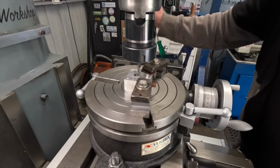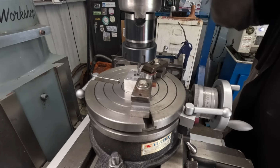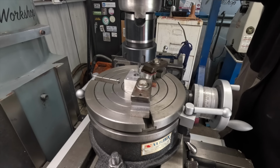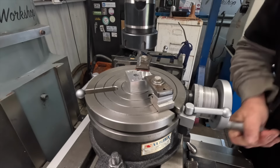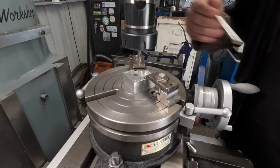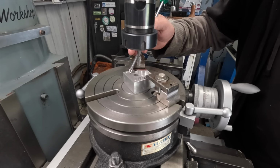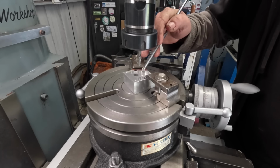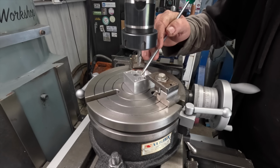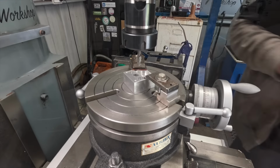Okay, I'm not too sure how well you can see here, but I'm all set up in the rotary table, obviously. Spin this back around. So I've got to cut all this out, 30.5 mm radius diameter circle. Across this point here is flat. I'm going to put that in first. It's a bit hard to explain. I'll grab the plan and try and explain it.